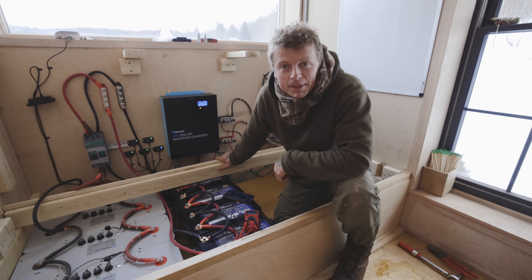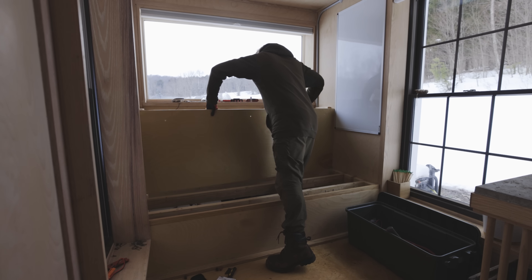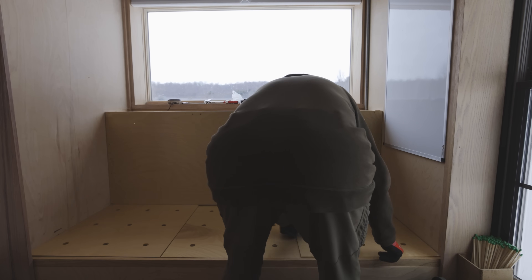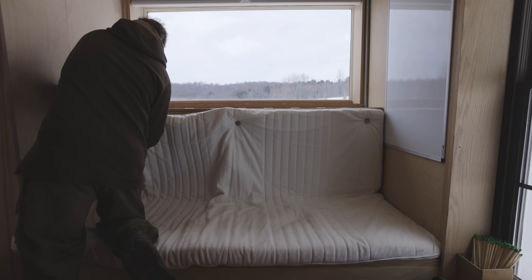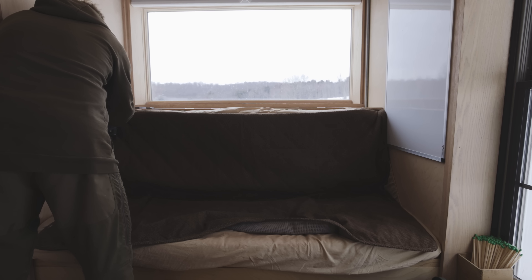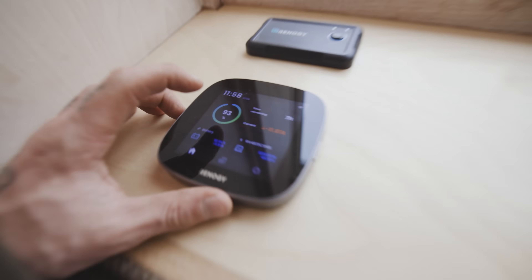I got the batteries fully charged. You have to charge each one individually, and then the manual wants you to put them all in parallel and wait 12 to 24 hours for the system to balance out — it's a time-consuming process, but we're all set now and the system seems to be working. We can reassemble our couch. It's honestly kind of incredible that there's an entire power station inside a couch. Panels are on the roof and my life just got so much easier — not having to run the generator all the time, not going into town to fill up fuel jugs, and no more noise.